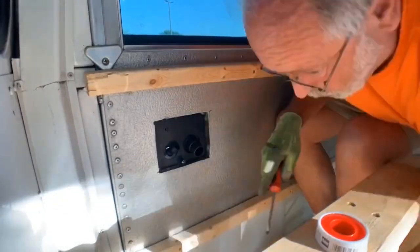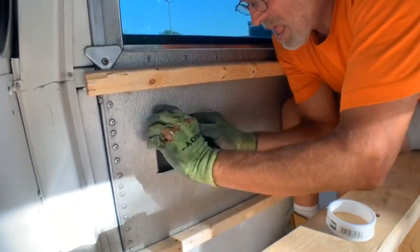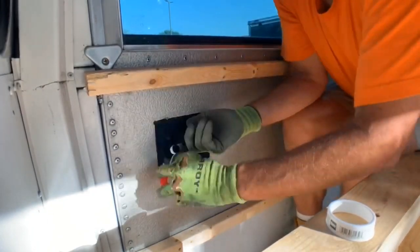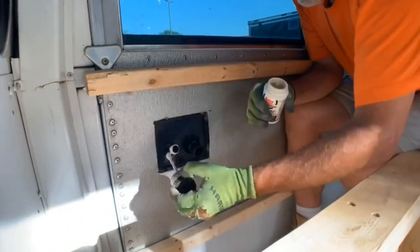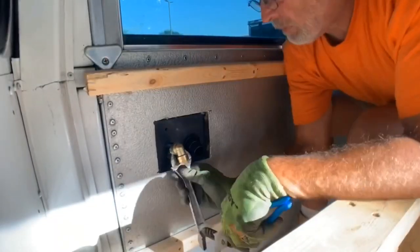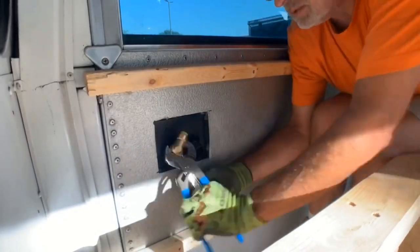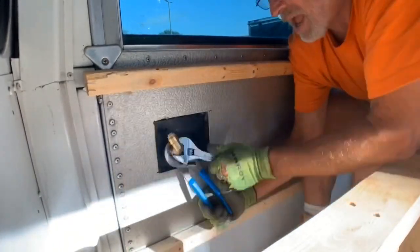Time to get back inside the bus and attach the lines to the door. The first thing we had to do was put a brass threaded fitting for the street pressure. Now if you saw last week's video, my dad talked about connecting two brass fittings — here we're doing one brass and one plastic. When you're dealing with plastic you have to be really careful not to over-thread or cross-thread, where the threads don't line up and you don't get a seal. You can break the threads on a plastic fitting, but otherwise the process is the same and you'll tighten them down.